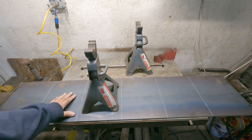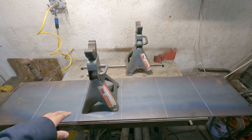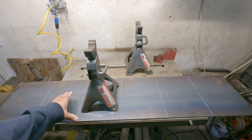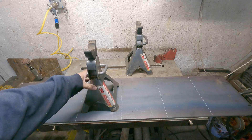The steel plate ended up costing less than $18, which is cheap for 3/16" plate this size. I got the six jack stands, and I'll weld them to this plate. That will make these sit on the floor a lot more sturdy — it gives a little more widespread stance and also strengthens them.